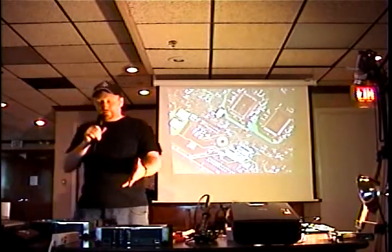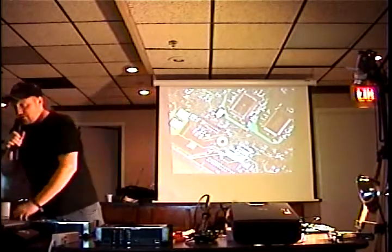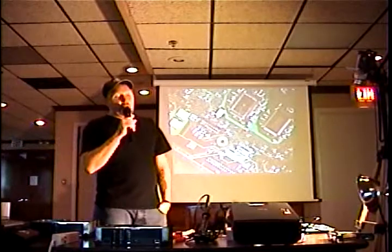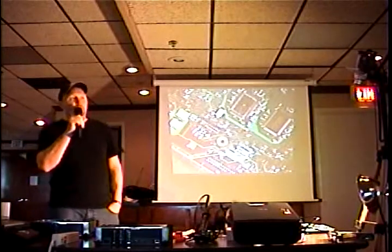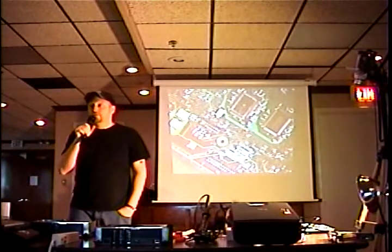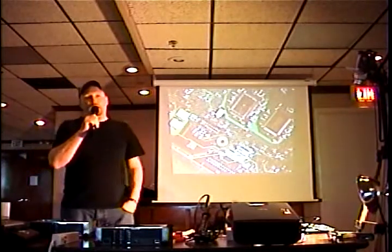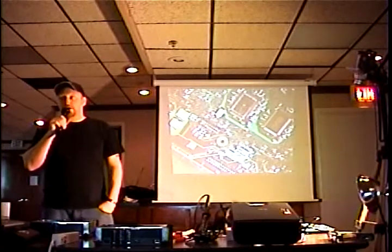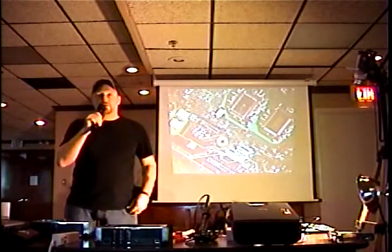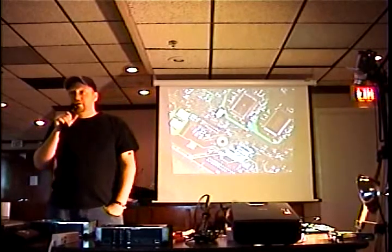You can put that new drive in, again, boot off of the auto installer CD, and choose the options to prepare the drive. If the drive is larger than 137 gigabytes, you will need to have an additional partition. For quite a while, nobody had a hard drive in their Xbox that was larger than 137, and everybody was telling us it's never going to happen. It's not possible. It's only going to accept 137 gigabytes. Well, somebody found out a way to do it in the BIOS, and now you can put whatever hard drive you want in there, as long as it's IDE. These things don't do SATA or anything like that. They're just regular IDE drives, 5,400 RPMs, anything like that will work.